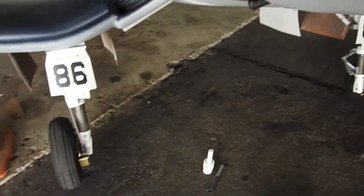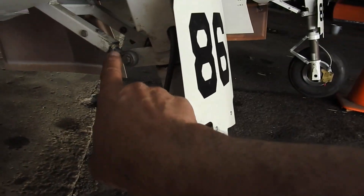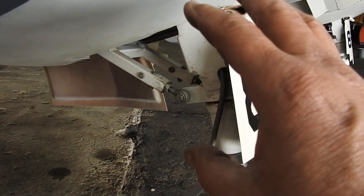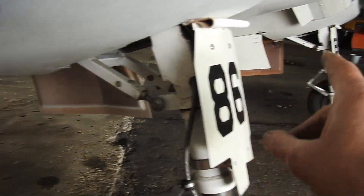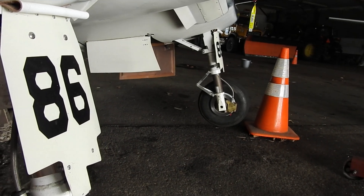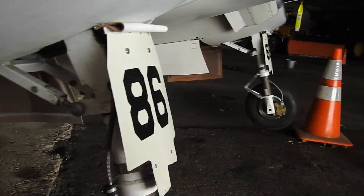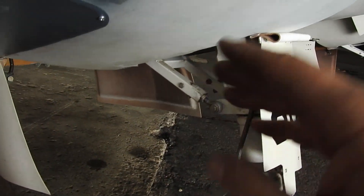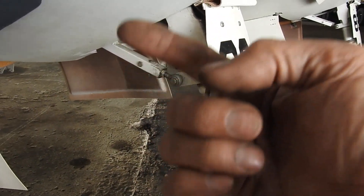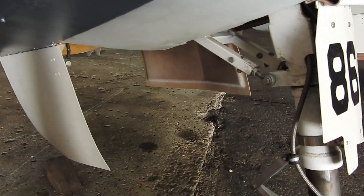The last thing I've been working on — because I had adjusted these gears out with these rod ends here, I had to screw them out. This side I had to go like two, three turns; that side was three or four turns — one was like one more full turn out than the other. But they're both perfectly in line with each other. And that caused some retract issues with hitting the switches, because these won't go back up far enough. So I had to readjust the switches to get it to tuck in that last one degree.